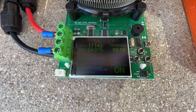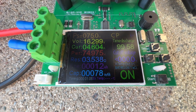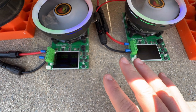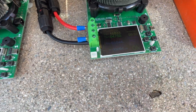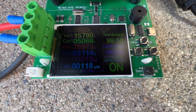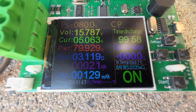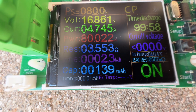Turning the load up to 75 watts, the Harbor Freight reads 17.1 volts and 4.3 amps, while the EcoFlow shows higher amperage but a lower voltage — about a full volt less — still delivering 75 watts. Bumping both up to 80 watts, the Harbor Freight reads 16.8 volts at 4.7 amps, and the EcoFlow reads about 15.7 volts at 5.0 amps. Recall that the EcoFlow reached 84 watts and the Harbor Freight about 90 watts on the power station test.